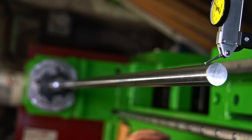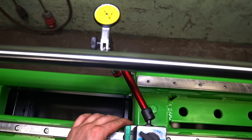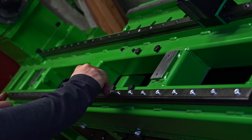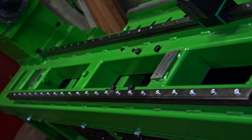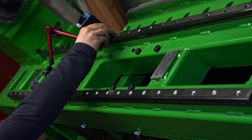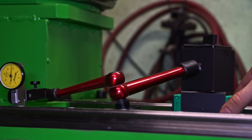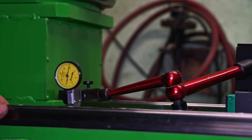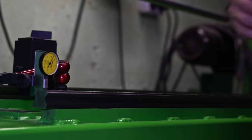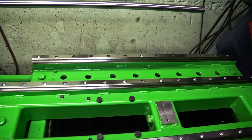After all, it will be adjusted later. Now when I think that those two are parallel, I'm adding the second rail with all the dial gauge measurements. And the last Z-axis rail — it'll be used for the tail stock.